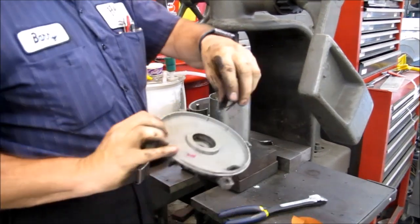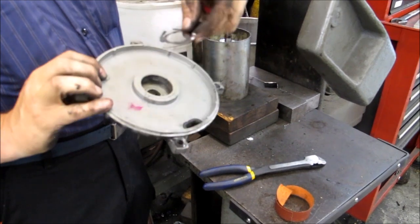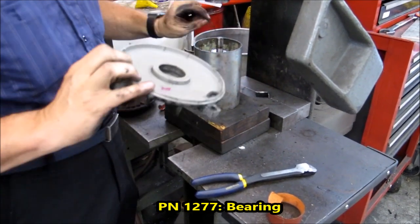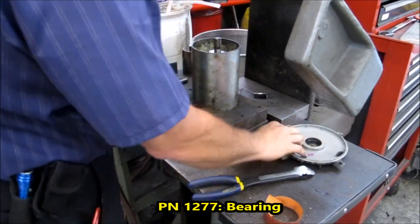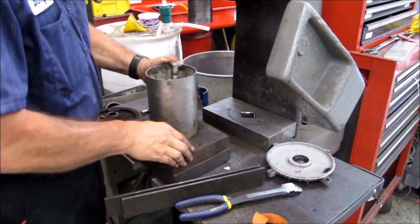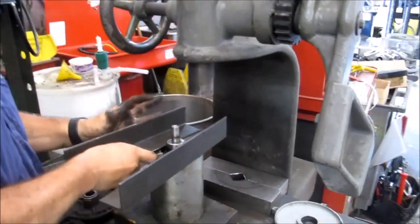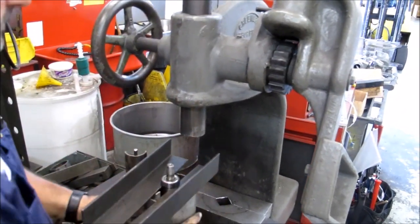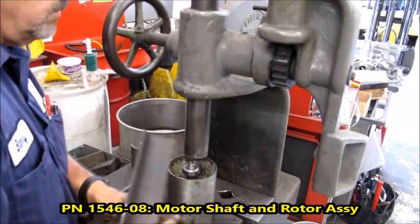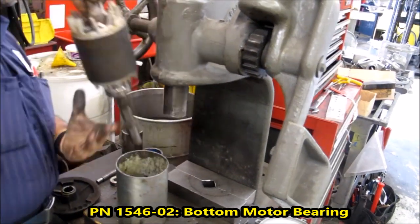You'll notice underneath here there is a washer. Normally it's this type of washer — the small side goes to the bottom. The parts that stick down are going to go on the bearing when you put it back together again. The bearings would have to come off at home with a press. We'll use our fixture. Take that one off, put the shaft out, turn it over.